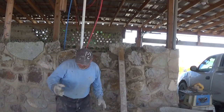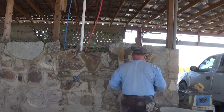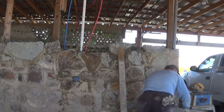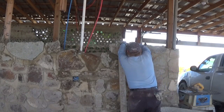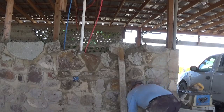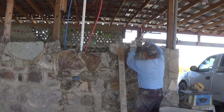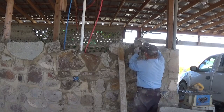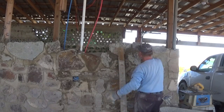Let me grab one that caught my eye. This rock has that black and green color to it — it'll fit right in there and fill my gap perfectly. I want the black side out. Ideally it would fit better one way, but I want that black side out. Now it's sitting — it wouldn't have sat had there not been fill in the back. This is a knife-edged rock, and the fill provides the support it needs. I'm going to walk around out of frame and double-check my verticality — this has to come out about three-eighths of an inch.